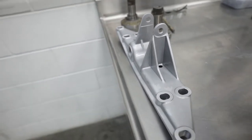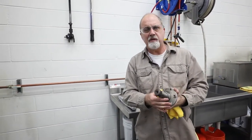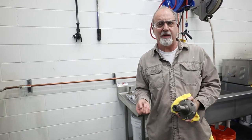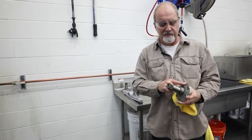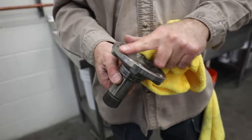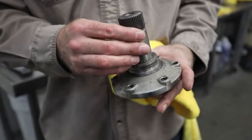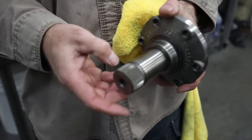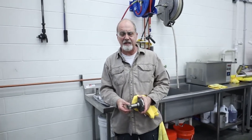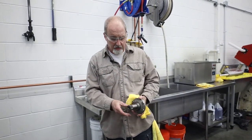There are times we'll go ahead and seal it, sometimes we leave it raw. The actual stuff's in the transmission. The benefit of using the Aquablast with the very fine glass bead is that we're going to knock off whatever dirt, scale, and oil. Machine surfaces will be nicely bead blasted but not etched — the same goes for the bearing races. Really importantly, all these splines — we're going to be able to get into these splines and clean these. So we know when we put the transmission part back together that it's going to fit perfectly — no dirt, oil, residue, or anything. Another real nice benefit of this. Then these are going to go off to yellow zinc chromate and be plated.